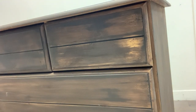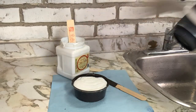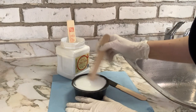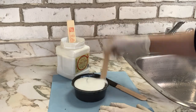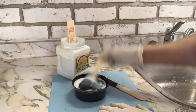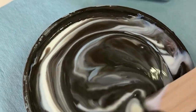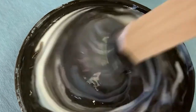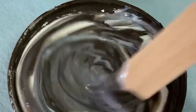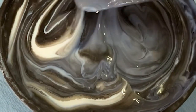I was really happy with the way my second coat of wash ended up looking — I was just tickled pink. So now it was time to top coat. To finish achieving an oil-based stain finish using water-based products, tinting your top coat will make a huge difference. It adds another layer of depth. I used my leftover Coffee Bean wash and added it to a satin clear coat — probably between five and ten percent paint wash is all you need. You don't want to add too much paint to a top coat.